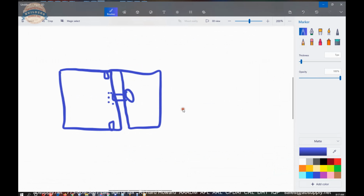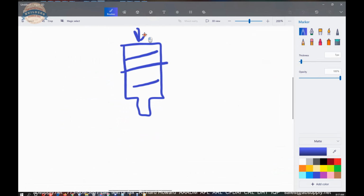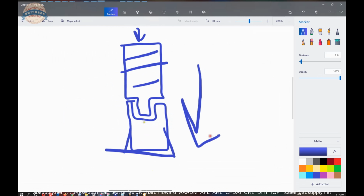The setting tool really is nothing other than a large piece of steel that you basically strike here, and your anchor kind of fits in there, and that sleeve portion is out here. An awful drawing, but you get the concept. And then you drive that down into what you're installing it into, the masonry, with the setting tool. That's what that is.